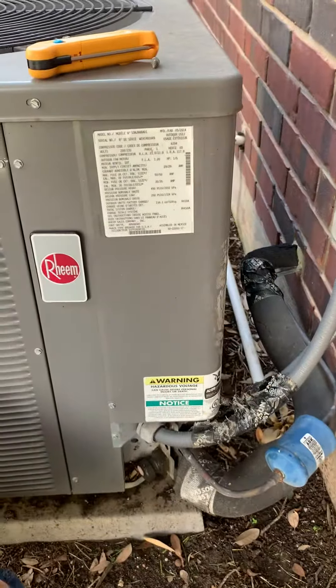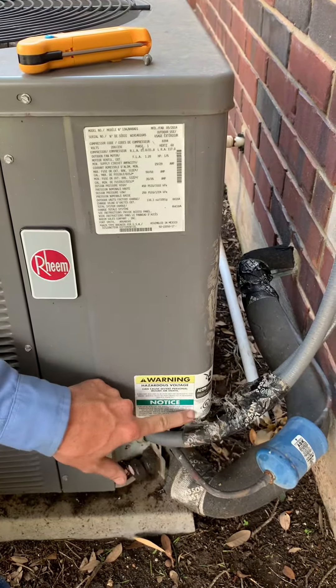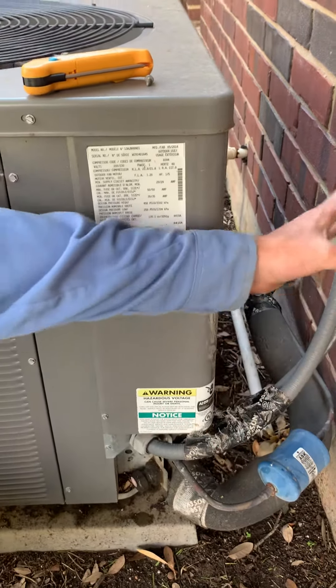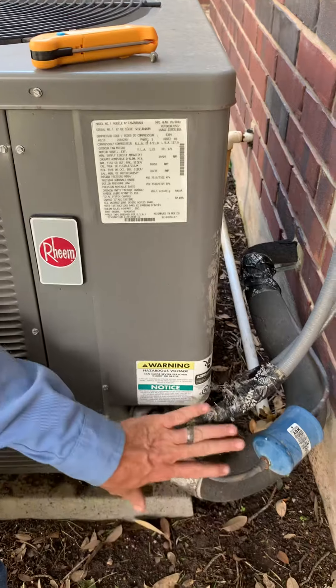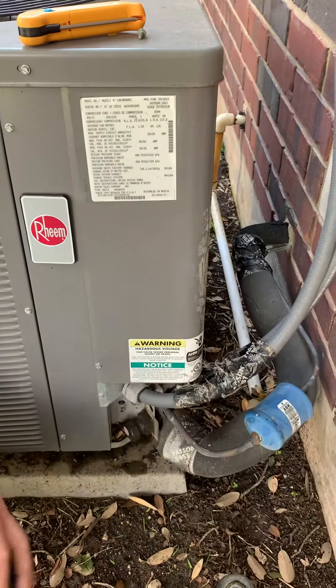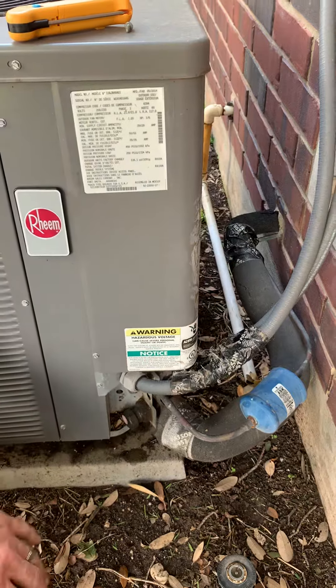You tried to take that panel off. The way they have this wire — because it's so short — prevents this panel from coming off. So we need to extend the conduit and the wire, give it more flexibility over here so we can take this panel off properly without shorting anything out or dropping the panel on the internal components.